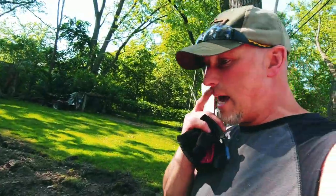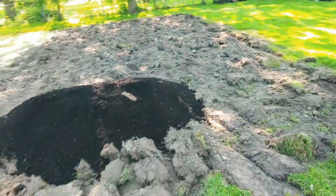Well, one side came off, and as I was pulling through some roots over here, it must have broke. Well, it definitely broke the lip on one of the bushings, and then it popped out because it pushed through on the one side, since it didn't have the C-clip limiting it. So I disconnected it, took it back up to the garage, took the seat off and stuff, repositioned everything, put a new C-clip in there, and ended up finishing it out. So I plowed it yesterday, and this is what we got.